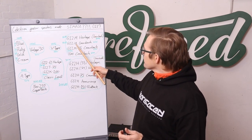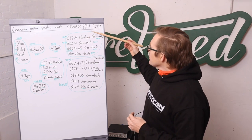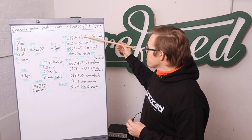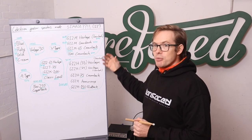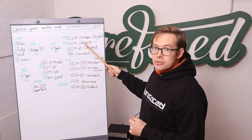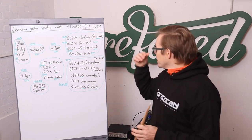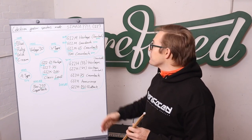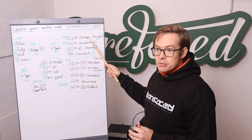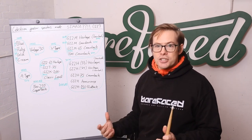These are your British-sounding, classic 60s speakers. The G12M Heritage and then the G12M Greenback — the slight difference is that the Greenback is less sensitive and has a bit less power. So if you want the 60s sound but without having to crank it to classic 60s rock band levels like Cream, you can use one in a Reformer 112 and get a big fat sound that breaks up at a much more reasonable level. It's a great speaker for recording, for home use, and still a viable gigging speaker in an efficient cab.